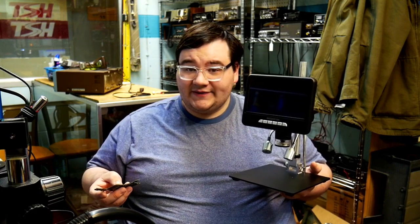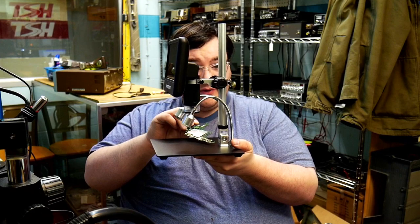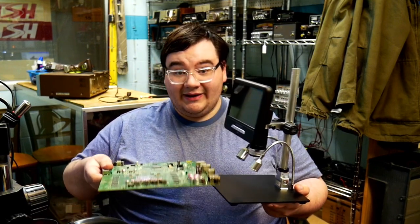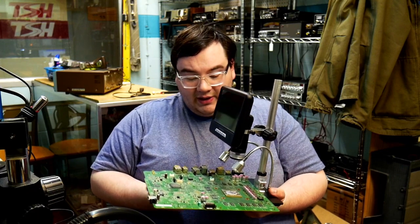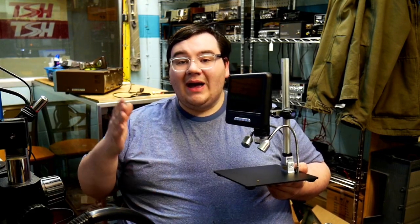Let me quickly demonstrate the limitations. With a smaller motherboard I'm able to see the entire board because there's enough space to move it around under the scope. But with a board like this, if the area I want to see is where these RAM chips are, there is absolutely no way my scope can reach that area. So if I need to solder a resistor there, that's my limiting factor. For daily electronics work, a scope on a boom arm would definitely suit me better than this one.